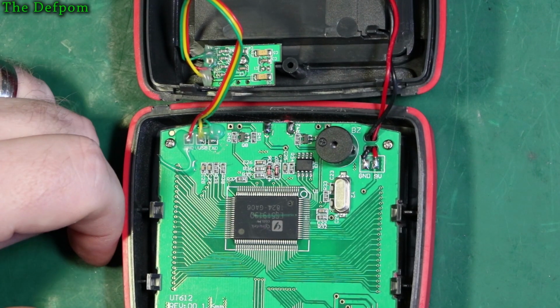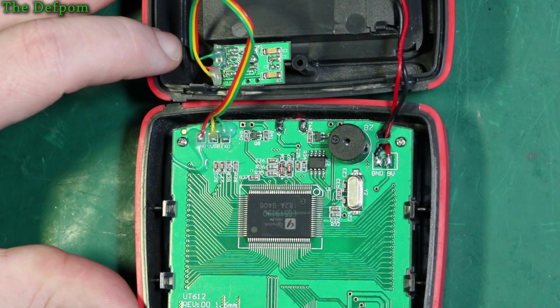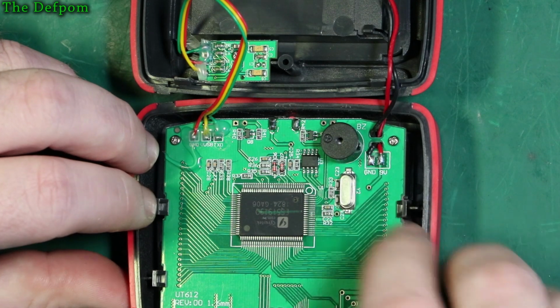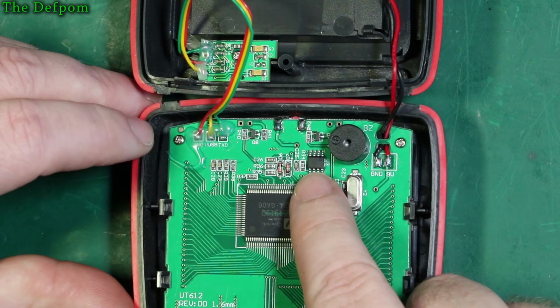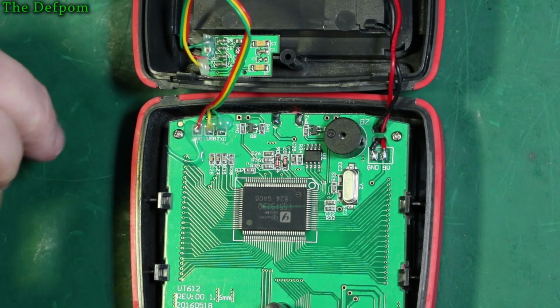And what can we see here? So we've got a display driver. Is it Sirius? I can't read this upside down. As Dave will say, the electron's going to fall out. Here's a crystal over here. I can't read what this is either. Is it 3.999 megahertz? Little buzzer, which you could hear. There's obviously some SPI ROM or something in there. EEPROM memory of some kind.